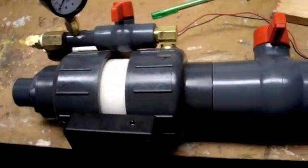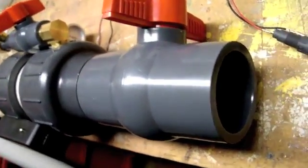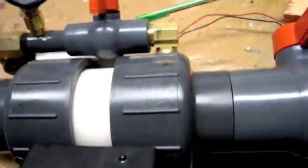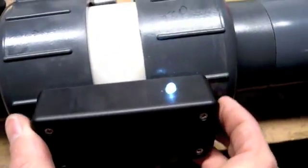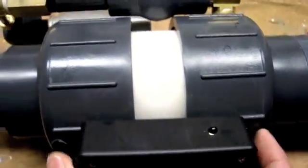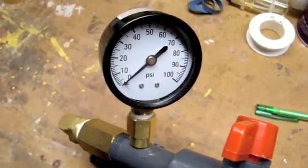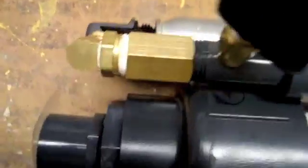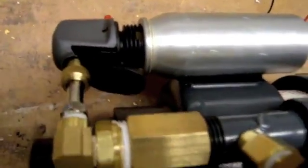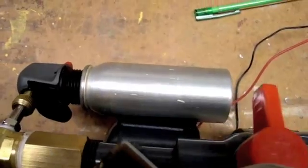Here's the combustion chamber for the 1-inch gun. This is a metered propane design, with a 2-inch ball valve for exhaust. There's the battery pack for the fan with an LED to indicate power on, the fuel meter, our pressure gauge, a little bit of pipe for fuel, and a small propane cylinder with a trigger valve for the fuel.